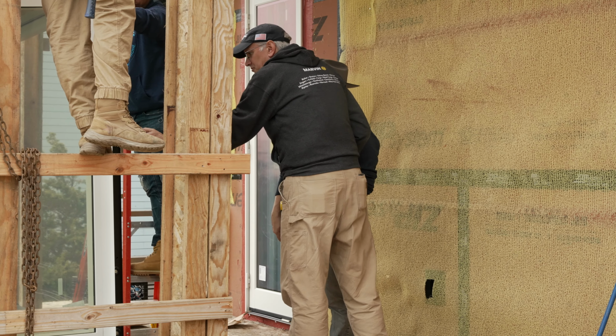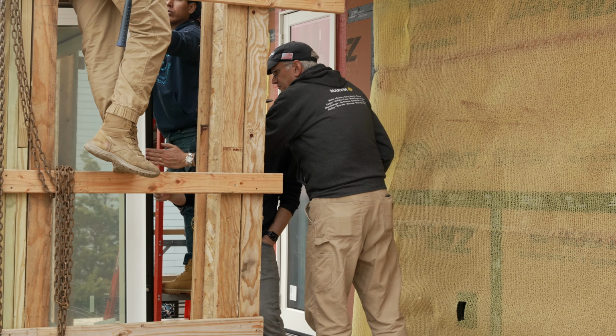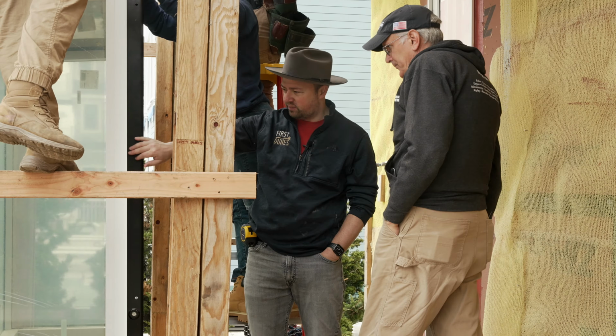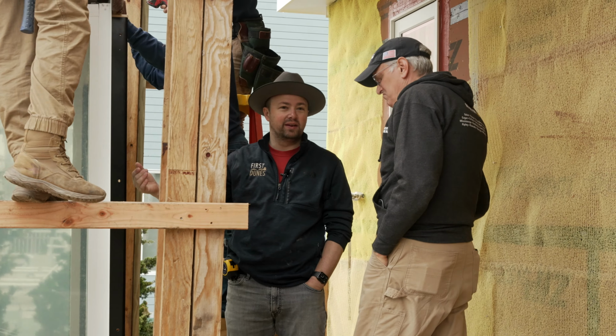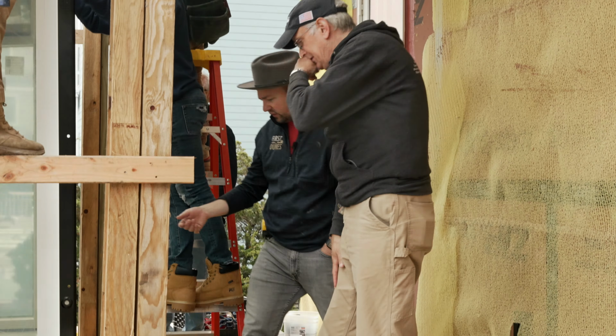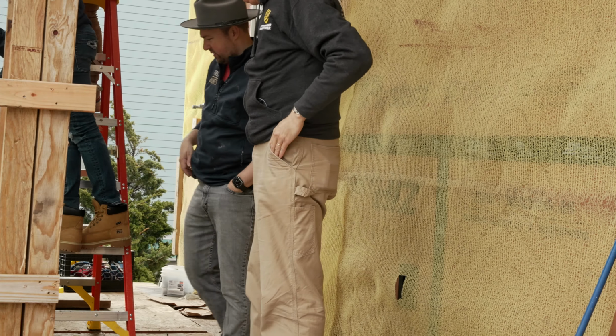Listen, you're running your drywall into here. Yeah. Okay. And you put in a rough opening here, you spray in this area. Yeah, we're not going to spray foam it. Pack it with mineral wool and Siga tape. We'll just spray foam your tube. Yeah, the instructions call to fill this tube and that tube and all of that with foam.